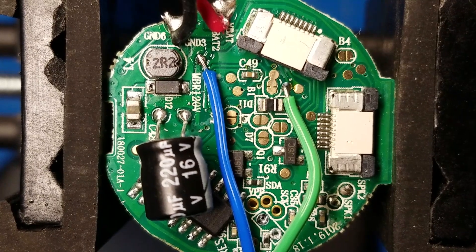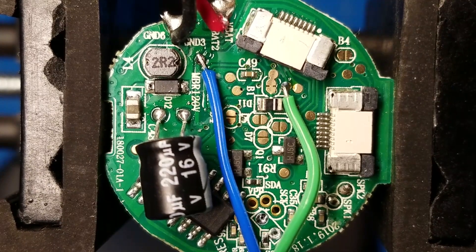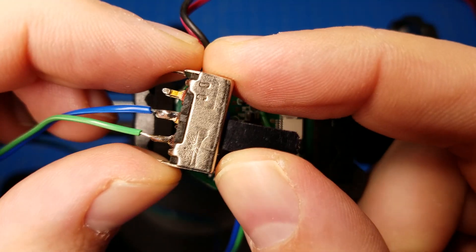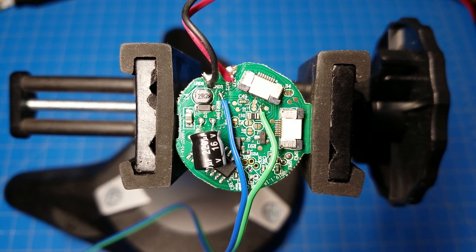Let me talk about what I have done here. I've added two wires. The signal that comes back from the switch PCB goes high when it needs to signify that the switch has been turned on. What I've done is connected the green wire — which is that signal pin coming back from the switch PCB — to the blue wire, which is hooked up to the voltage that goes out to the switch PCB. At the other end of these wires is a switch. So when I want to turn the lightsaber on, I just close the switch, and when I want to turn it off, I open it. Just a couple of wires. In theory, the next step is to figure out how to test this.